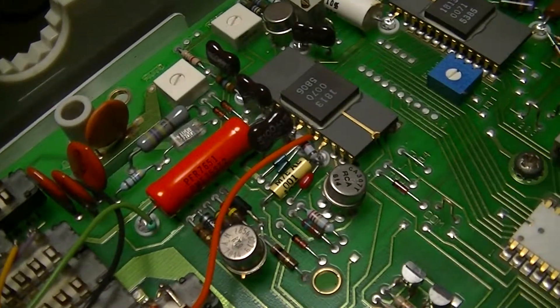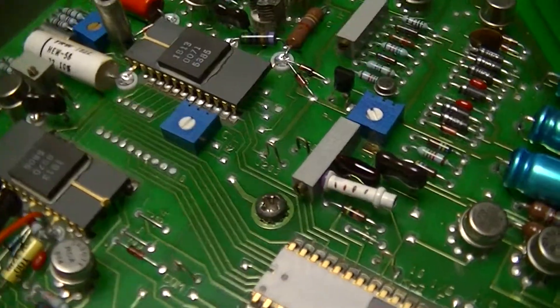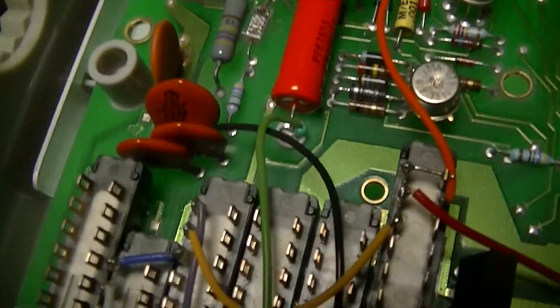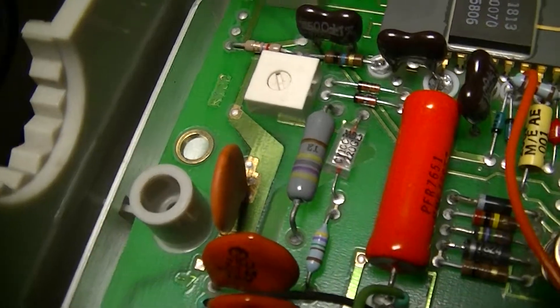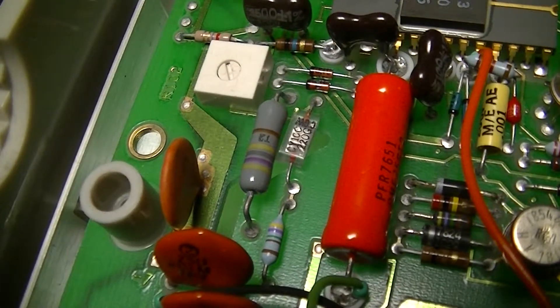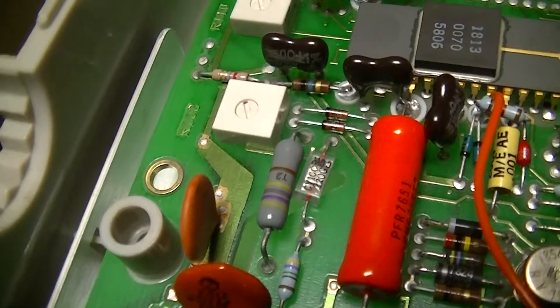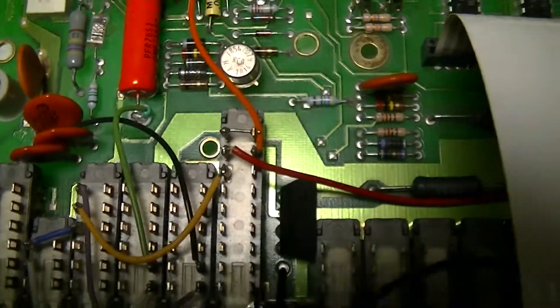It's actually a somewhat common technique. Aside from a bunch of other miscellaneous passives, over here is the clock generator circuit for the main control chip. The only other really super interesting thing to note is this Corning Glassworks device, which I'm guessing is either a diode or a capacitor. It's marked CY1CC220G — I don't know exactly what that is.